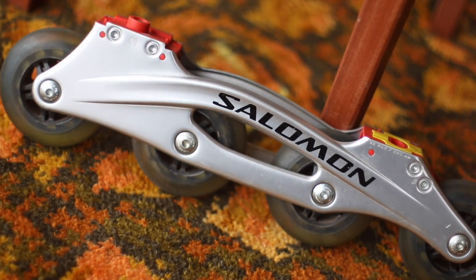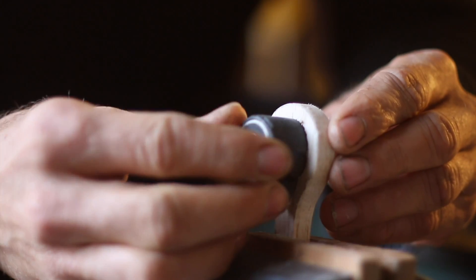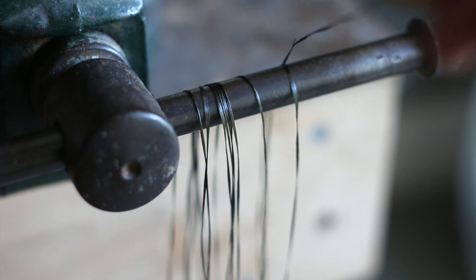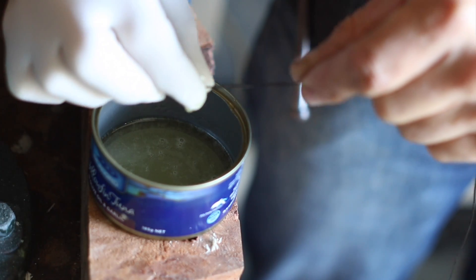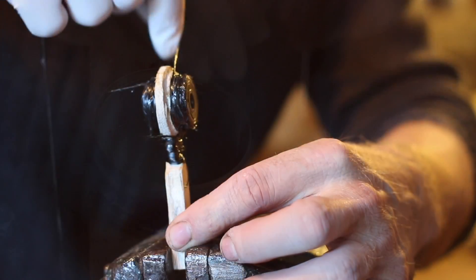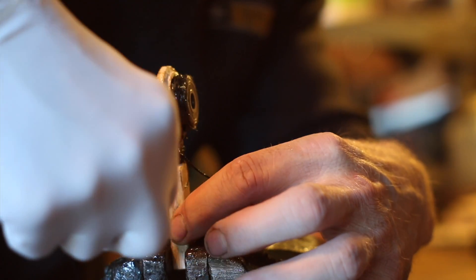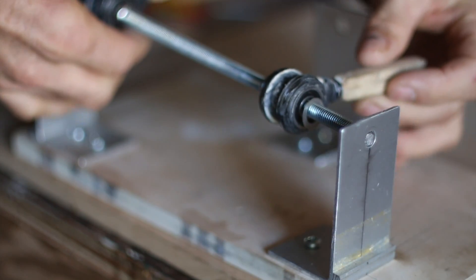I had the remnants of my old rollerblades and thought now's my chance to use the bearings and bearing cases — I'll make a gimbal out of them. I only had this carbon twill cloth lying around, and for anyone who's tried to wrap twill cloth around complex structures, it simply doesn't work. So I decided to pull the individual strands from the twill cloth, force epoxy resin through them, and then wrap them around a balsa wood skeleton. I was quite surprised that it worked better than I thought, and it was really, really strong.